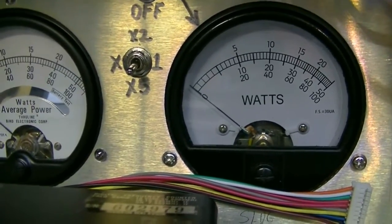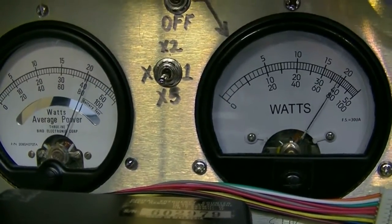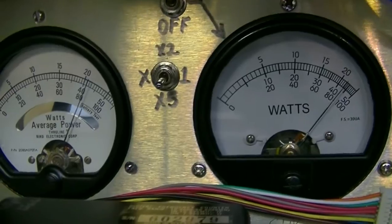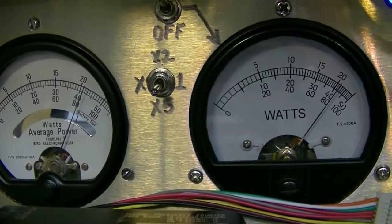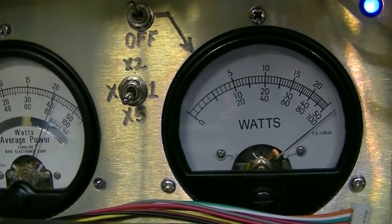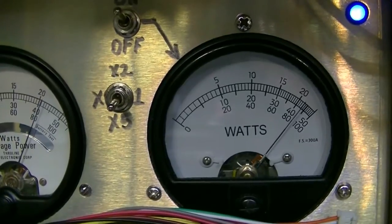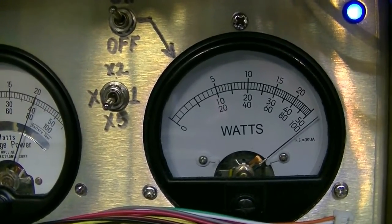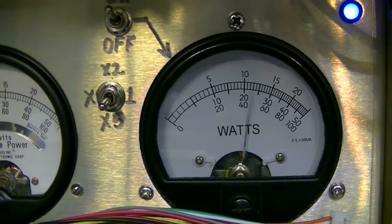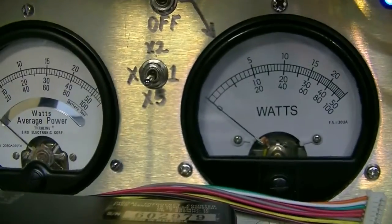Now I just turned the amp on. We're dead keying about 83–84 watts, and peak is — well, you can see where peak is. Audio count one through five and back. And yes, that was the lights on my workbench dimming.